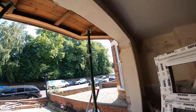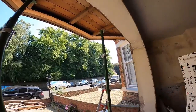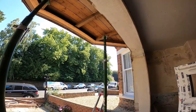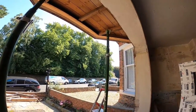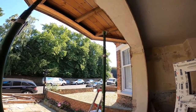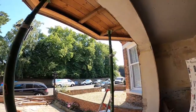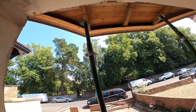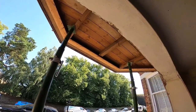So what I've had to do now is, you'll see I've had to tuck the top bit of wood down. I was hoping to leave that in, but when I've had the frame up against it, it's not quite in the right position. It's sort of a couple of inches too far forward. So I've took it off. I'm going to put the frame in, build up another frame on the inside that'll sort of like support where the wood will go. And then I'll see if I can either reinstate the old piece of wood, or I'll go and buy some new timber tomorrow, or next week or whatever, and sort of refinish it. I might do it a bit of UPVC, but it'd be nice to keep some of the timber if I can, so we'll see how it goes. And while it's like this, I'll insulate up there as well before we re-plaster it.